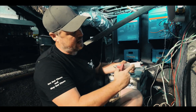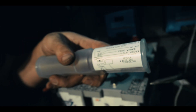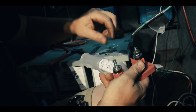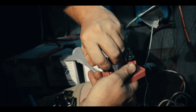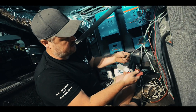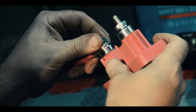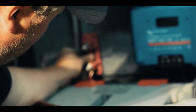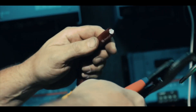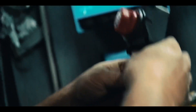They actually have a diagram on here showing how they want to see this all go together, so we just want to make sure and follow that. We have our jam nut first, then our locking washer, then our flat washer. Under that is our nickel plated spacer — we leave that there, that's what our terminal goes against — and we're going to attach this right there.